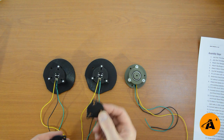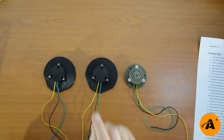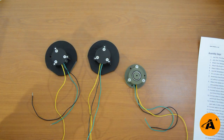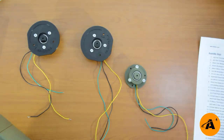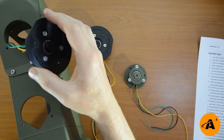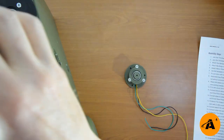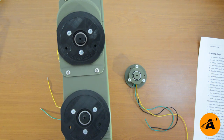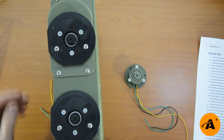Those are the wires on. To finish off step twelve, we've got these plates which go over the back, with M4 eight-mil countersunk screws — it's got a chamfer on the inside. Number thirteen gets exciting because we're going to fit the aileron trim and the rudder trim to the case. We drop the wires through here — the shorter wires, the 20 cm, go in first. With the lettering to the front, it drops in like that. And then we use eight-mil round head screws to fasten that. That's a nice bit of progress.